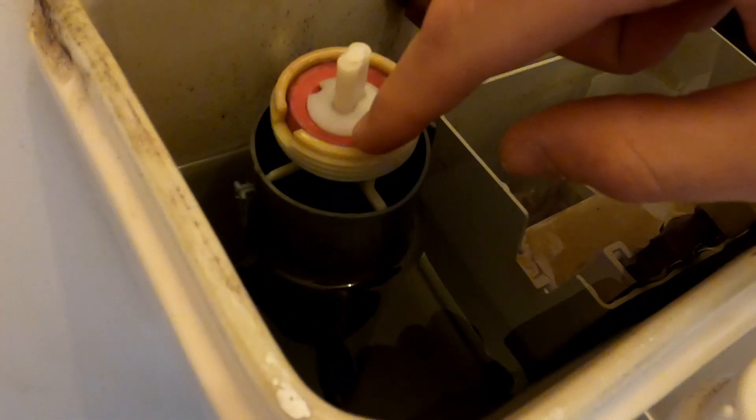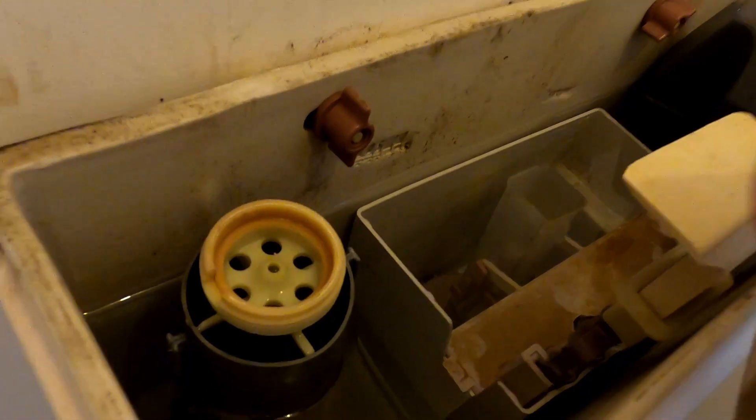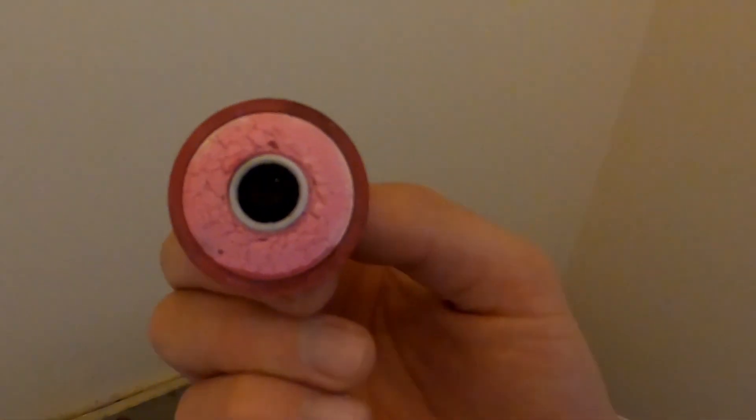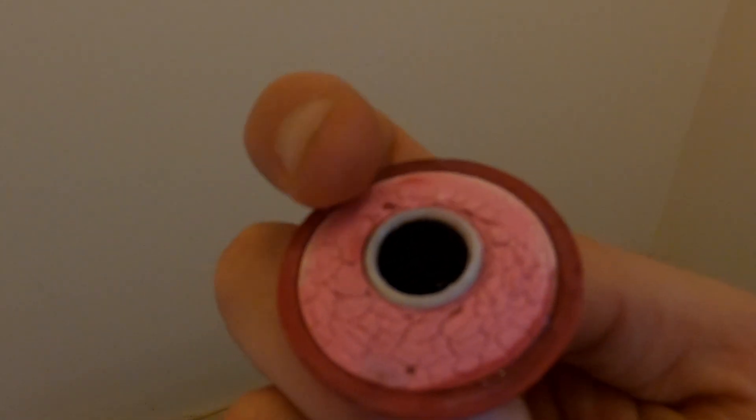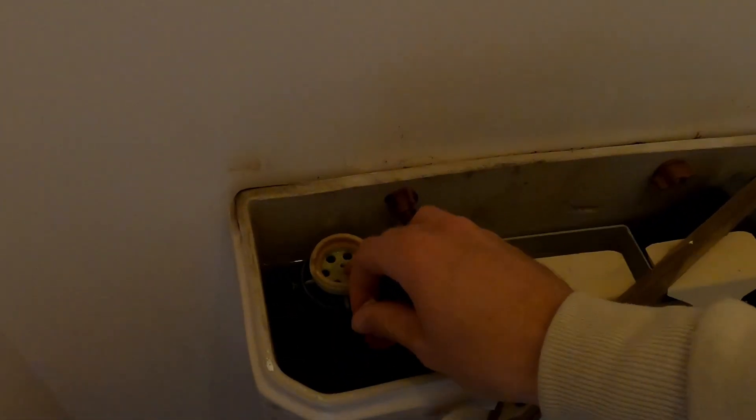When you look in here you can unscrew this and you'll see the water level is right at the right amount, but if it gets too high it starts to run down just here - and that's what was happening. Essentially water was coming up and through here consistently. The ball cock valve wasn't sealing and water was just simply running over the top and running down the loop. When we discovered this we saw that this valve had aged quite a bit. It's perforated, it's not sealing, and therefore the water can be running up through this spot. So today we're going to replace this, fix it and get it as new.